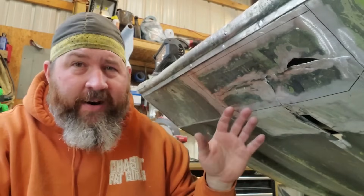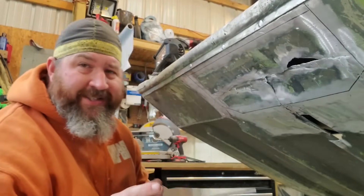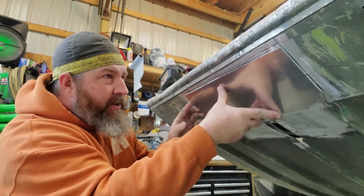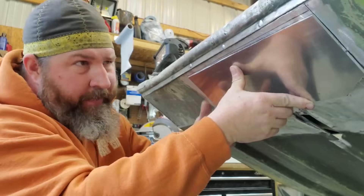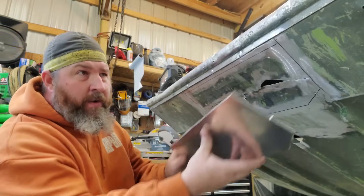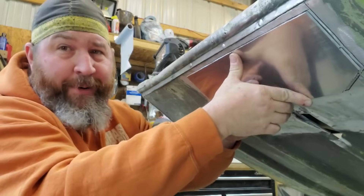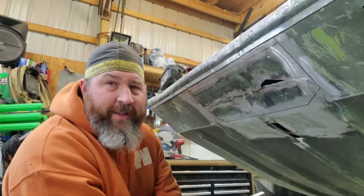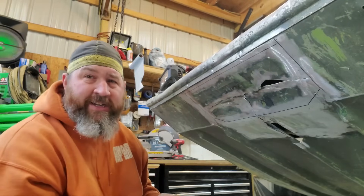To fix this I'm going to cut out the center rib, plate the center part, and then weld the end of that rib. I've prepped the area and cut a piece of 3/16 plate with a little bit of shape to it. Once you put your plate up there, make sure all surfaces line up properly with minimal gaps. There's a high spot at the bottom corners where the previous weld plate was, so by removing the corner my plate lays down a little flatter. Pro tip: once you get your plate cut, mark the perimeter with a marker so when you take it away you can verify the area is clean.